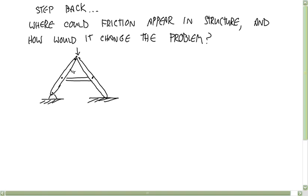We have so far broken contacts like this up into, and I haven't done a lot of problems that had contacts like this, but when we talked about joints, I did discuss it. So far we've only had two ways to treat this: totally frictionless and totally rough, meaning it can apply any amount of friction required so that this doesn't move. Okay? So how would this problem change now if you had, what if now this wasn't totally smooth and it wasn't totally rough? So we had some, say, coefficient of static friction. Okay, what would change about this problem from what we do now?